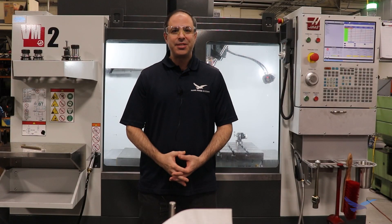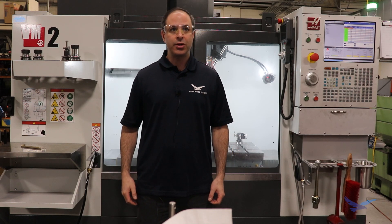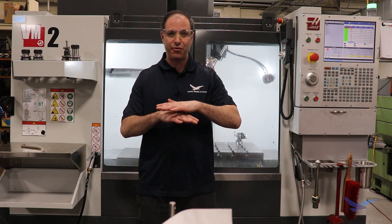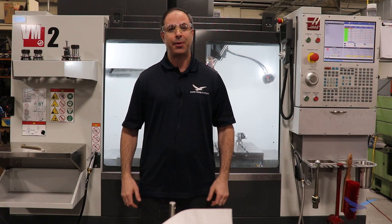Awesome - thank you, Breeland, for sharing what it takes to design conformal coolant channels in SOLIDWORKS. With no further ado, let's see if we can cut some metal. I'm standing here in front of a Haas VM2 3-axis mill, and we're going to use our cutter body to cut some aluminum. We'll start with lighter cuts around 1,000 RPM and 49 inches per minute for surface passes, and then step it up to 1,260 RPM and 34.3 inches per minute for some deeper cuts.